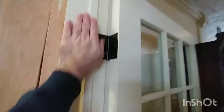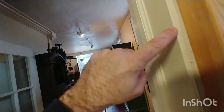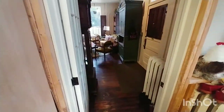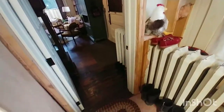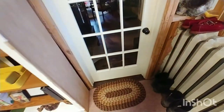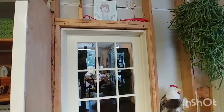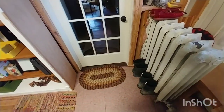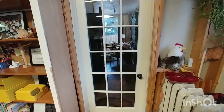Anyway, got the stop painted out. That came out nice. The back of the jamb wasn't painted, and it has a bit of a witness and little bits of hard caulk from where it came out of before that I didn't bother to sand off. But as far as making things look good when there just ain't no way of doing it, I felt like painting around the corner and painting the jamb completely against the rough framing was kind of the best look for an otherwise finished piece of millwork installed in a rough opening that's too deep for it right now. So since we obviously live with an unfinished wall right here anyway, this was, you know, again, good enough.